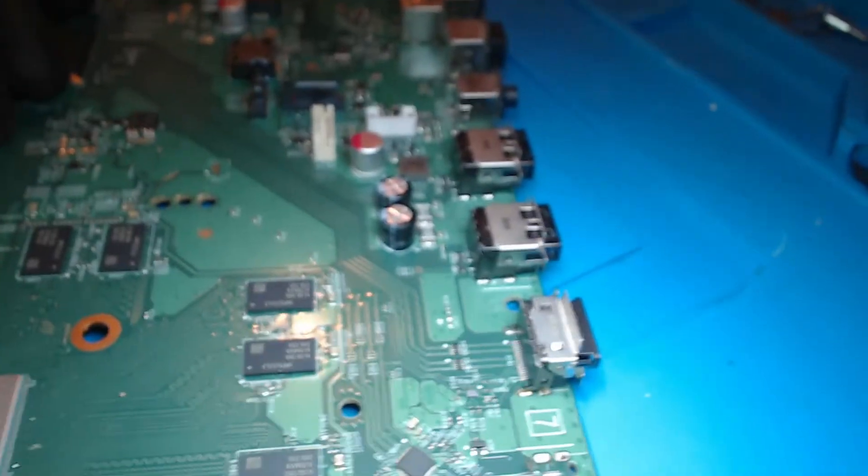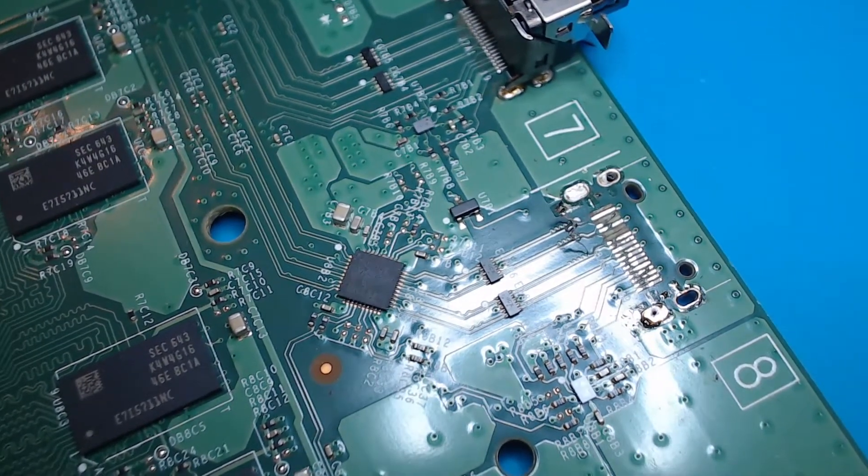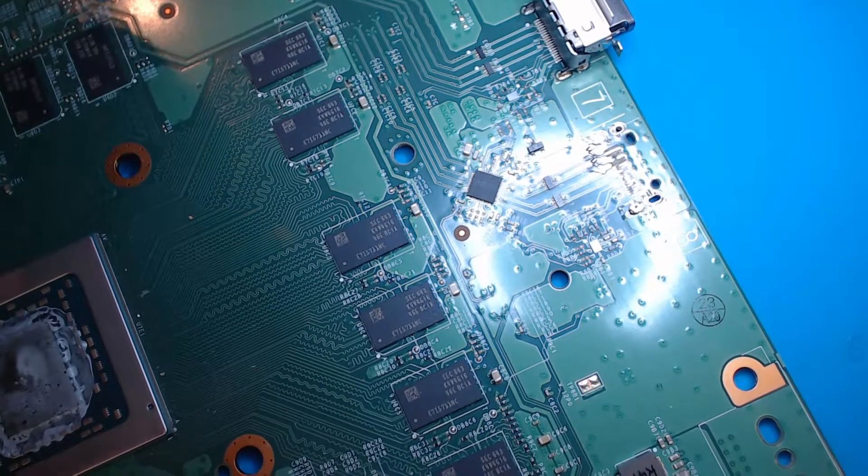Let's get this down on the bench and try to get you focused in here. So you can see there's about four or five traces ripped. What I'm going to have to do is look under the scope and just see what we're actually working with. Four or five traces ripped — it's quite annoying. It's looking like we're going to have to do some sort of trace repair. I've got a feeling this has been opened and a repair has been attempted on this one.